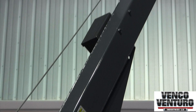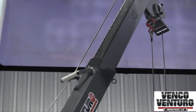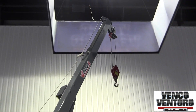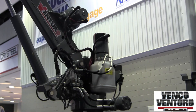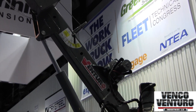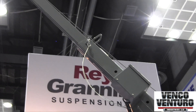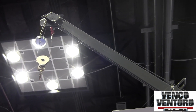We have a crane in between these two — it's an 8,000 foot-pound crane with 3,200 pound capacity. We go up to 6,000 pounds in the electric hydraulic. The full hydraulic cranes have a similar look but they don't have the electric power unit or the hydraulic reservoir next to them. Those cranes pull from a bulk mount reservoir up in the front of the truck because they're utilizing more hydraulic fluid.